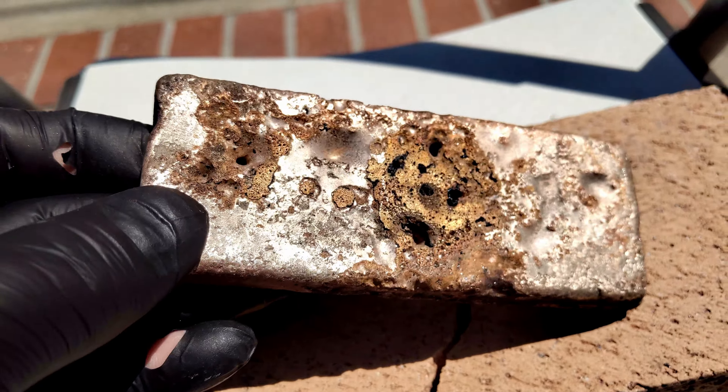Got another one here. This was made with dirty copper and dirty brass, which I guess is dirty copper. Again, no borax — challenges cleaning before the pour. Again, preheated the mold. Less holes in this one, but still some pretty big ones. The crucible held up a lot better in this pour, and you can see the indent here again from the same mold — need to file that out.